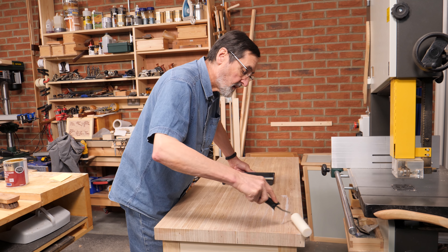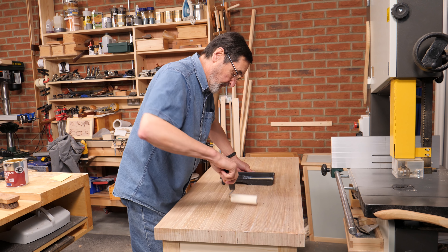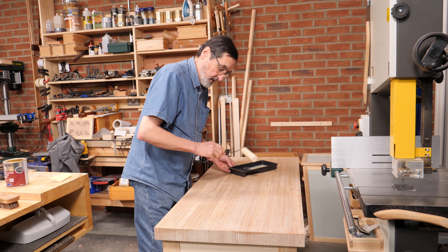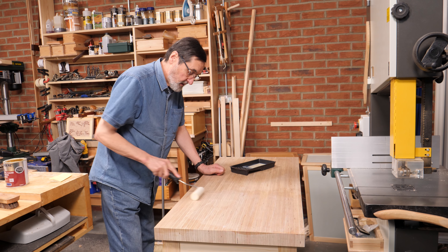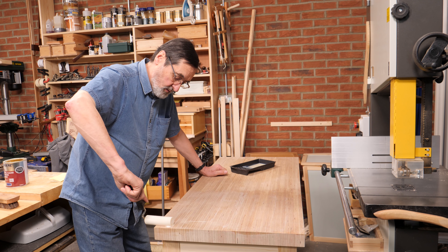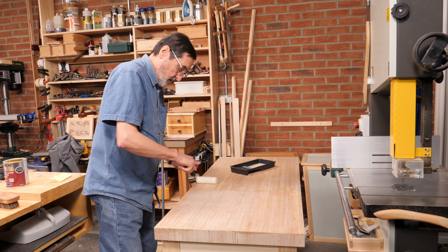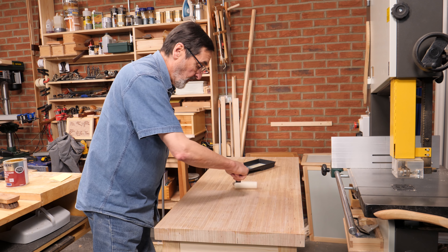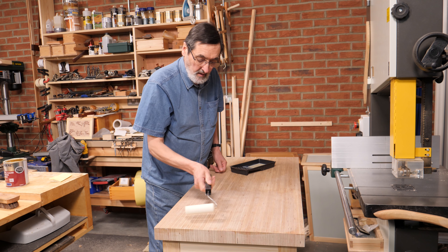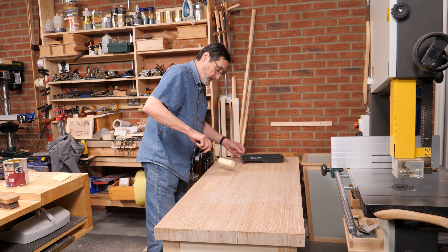I'm rolling this on, and normally I would roll it on and then go with a paint pad to stretch those lines along the grain. But I'm going to just roll this on and see how it feels after. I'm watching this over 24 hours to see how the finish stretches once it's dried — going across the grain and then with the grain with a roller. Most manufacturers don't advise using a roller, and I think it's because rollers tend to put bubbles in the finish. But I want to see. I like these experiments — they often come up with something new.